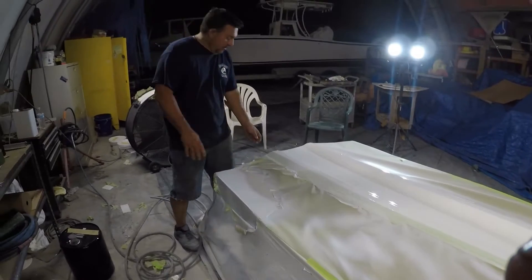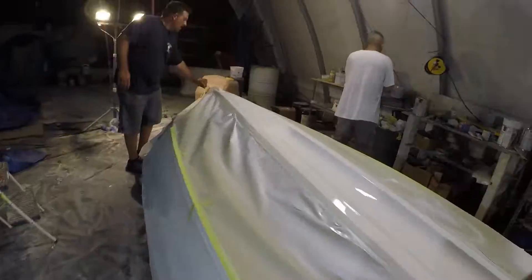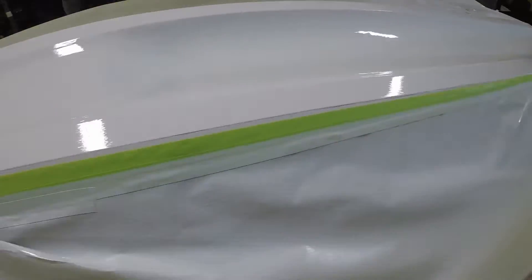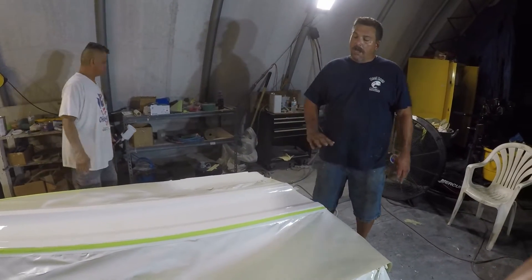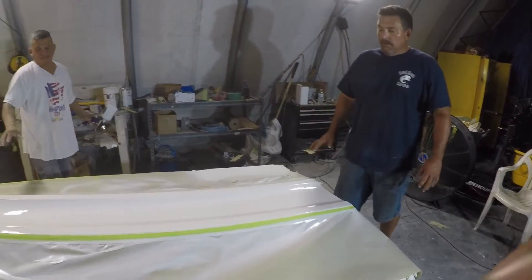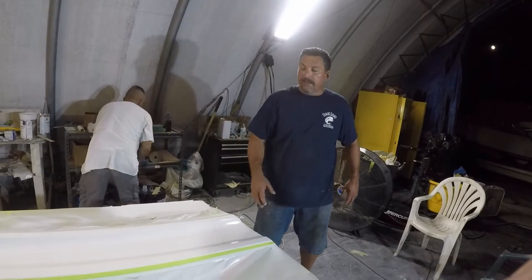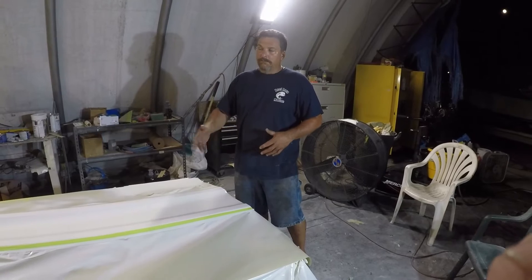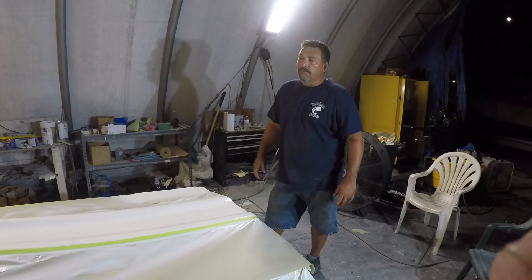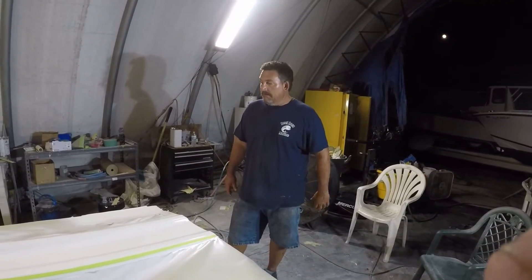Now that we put the coats on here and here, we're going to peel the tape. We let this cure and tomorrow we'll see how it looks. We have one more coat — the last coat will cover everything at one time. We built this up two layers here; previous videos we built up the other two layers and made modifications in the front and back. Now we're just catching the two sides up, and then the final coat will do it all in one shot. After this cures, we hit it with blue dye and 36 sandpaper to check for any more filling needed — that will show us the high and low spots. See you next video.